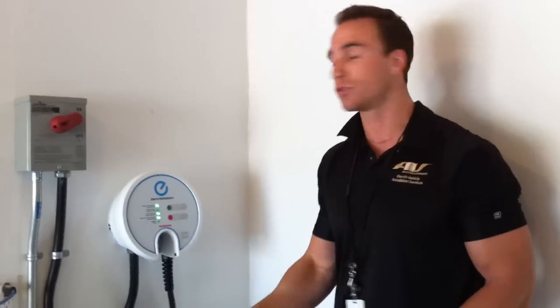The same thing applies if the car is not fully charged but you've programmed the car to only start at 7 o'clock at night, because that's the off-peak time. You can set a time to start charging in the vehicle to take advantage of time-of-use rates where the rate goes down. So you can hook it up and it won't do anything until the car communicates and tells it at 7 o'clock it's time to charge.